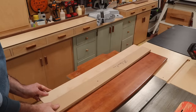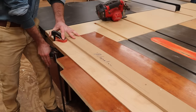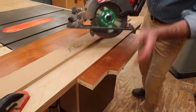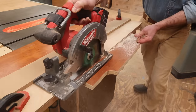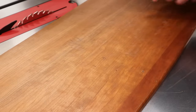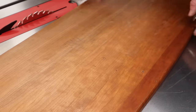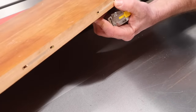I'm using an old cabinet top for this project — it's solid cherry except for the plywood bump-out on one side. I'm using a straight-line rip jig and the circular saw to cut off the plywood. Now I've got a good straight edge on this side, and I'm going to adjust the fence to eleven and three-quarters to cut off that screw hole, then readjust the fence to eleven inches to cut off these biscuits.